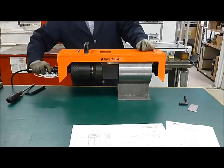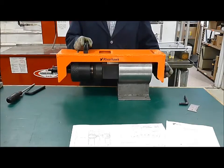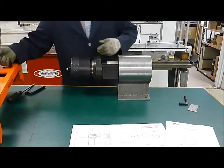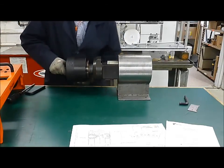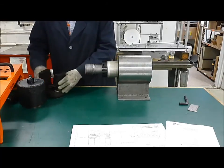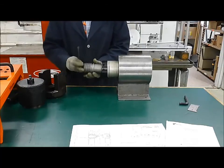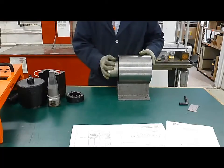Next step: disconnect the hydraulic hose and loosen up the clamp. Remove the guard. Remove the cylinder. When it comes off, the pull screw will be snug in there — remove the pull screw and the spanner ring. You're ready to go to your next stud in the pattern.